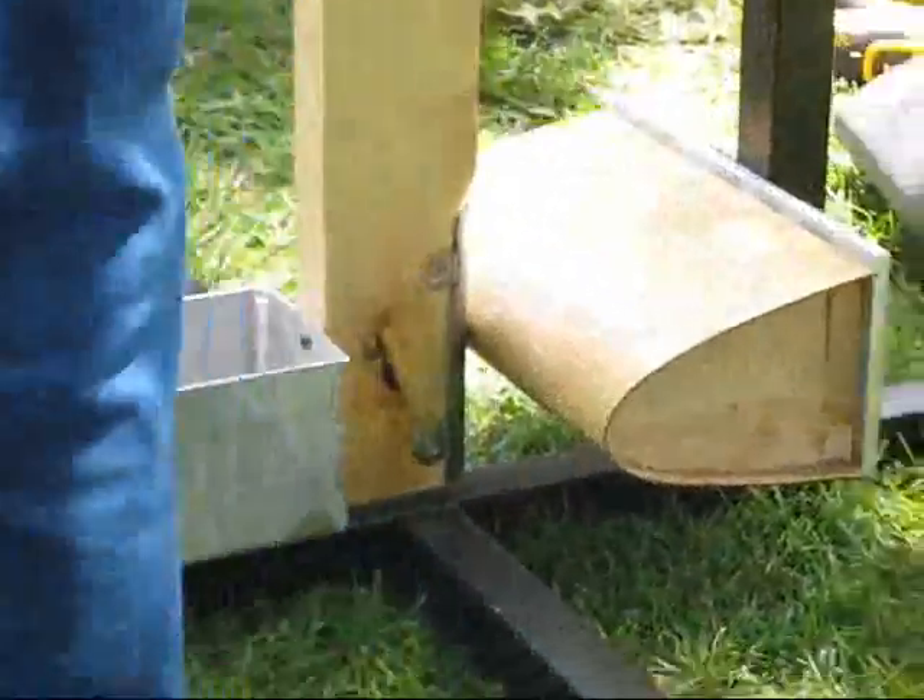Would that be comparable to the thickness on the wing of an airplane? Yeah, one layer of eight-ounce Kevlar in the middle. And the alternative would be three layers of carbon fiber. If it doesn't prove out stronger than this, then I'll make another one and we'll try that one.